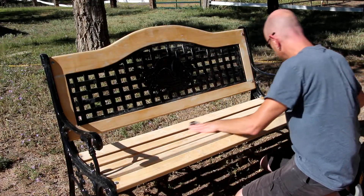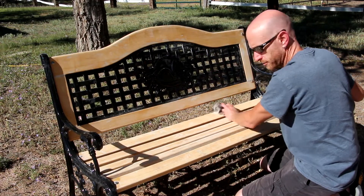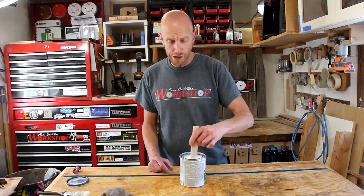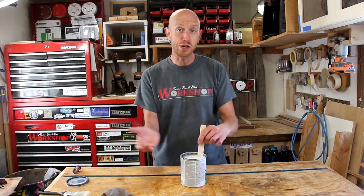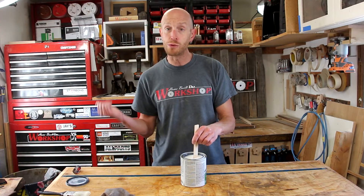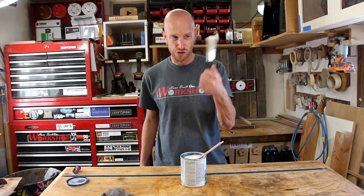Right here, I'm just wiping off all the dust with a rag so that we can apply the new finish. I think we are ready to put on a new coat of clear. We can grab our finish of choice and stir well before using. In my case, I'm using some water-based spar urethane — I believe that's what I recoated this bench with a year ago. Just going to apply it with a small brush; I wish I had a little bit larger brush, but this one's going to work.